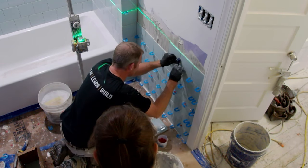So on that back wall where I had all that downlight, especially at mid-level, you can see any little bit of shadow. So I really was concerned, and that's all coming from experience, because I've done it before. After everything was grouted, you could see some of the shadow. It wasn't like you could feel it that much with your hand, not a whole lot of lippage, but it was enough that the 4K camera definitely picked it up.